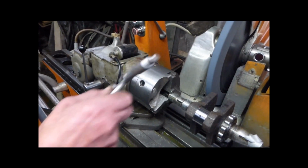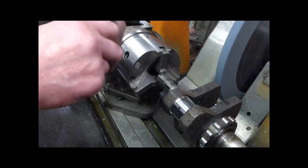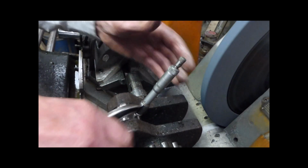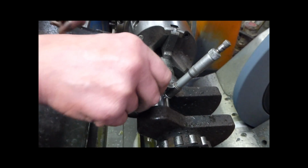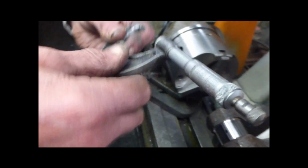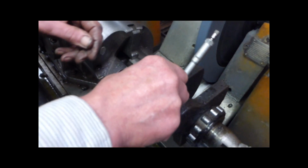Well, I'll show you how sensitive it is. Let's move that out the way of the wheel now. We'll finish that. See, if I set that, I'll lock it up. That's locked up at that. You see, that just holds on there, see? Oh, yeah. But it's just that little bit over. If I move it to halfway, see, I only moved it at halfway, look. See where I moved it to halfway, half a thou over. And that drops on there. See, it won't stay there now. It drops past, just by moving it that much. It's only about a quarter of a thou.